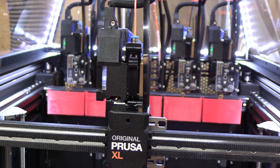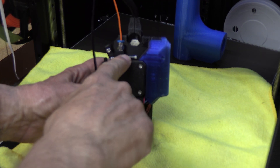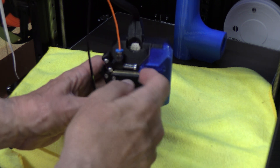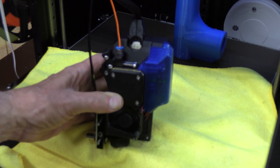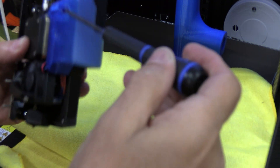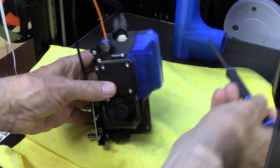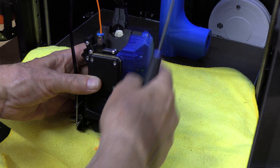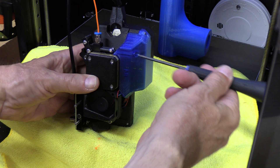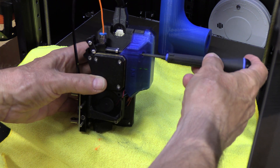But then I realized that wasn't the right thing to do. What we need to do is adjust the tension on these rollers, on these two screws that have a spring here, and that takes a two-and-a-half millimeter hex drive. I printed some new covers that go over the dwarf board that have a hole in them so you can adjust these. I tightened these up.